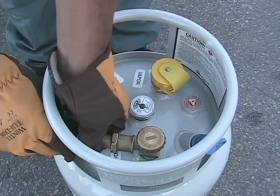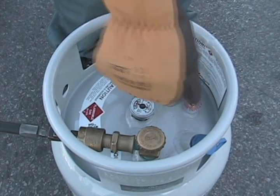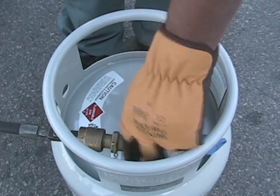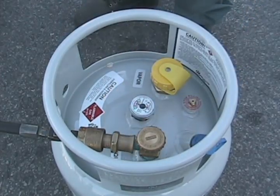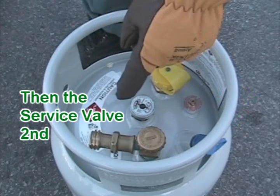The use of a motorized pump or larger filler valve will be covered in the next video. The first valve to be opened is the 20% outage gauge on the forklift tank you're filling. Now go ahead and open the service valve. It's a common mistake to open the service valve first. By opening the 20% gauge first, you're sure to maintain the proper pressure and fuel level of your tank and ensure proper filling.